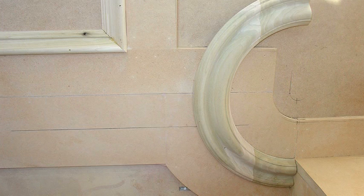And then this is the next step. This is for the next long point and short point. Right, so now I have the tangent 2 points, and I marked those 2 points on both pieces of the molding, because that's basically where the cut line is. Okay.